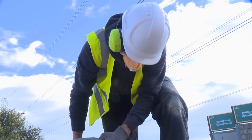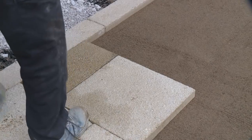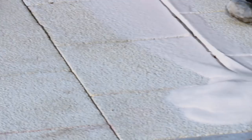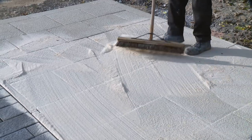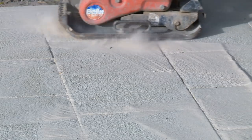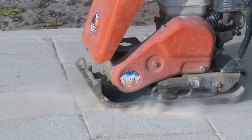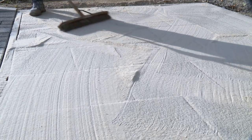If using a diamond tipped cutting blade, use an appropriate dust suppression technique using water. Cut the blocks as accurately as possible, ensuring the correct PPE is worn. Install the paving flags and cover the final installed area with jointing sand using a brush — here we've used kiln dried jointing sand. Make sure at all times when using kiln dry or silica sand you wear a dust mask. Compact using a vibrating plate, consolidating the sand into the joints, and top up the joints with more sand if required.